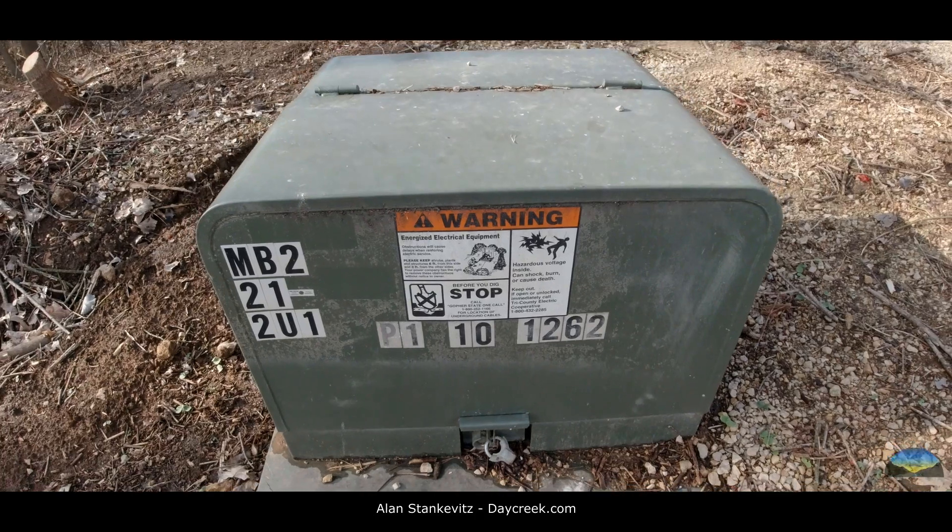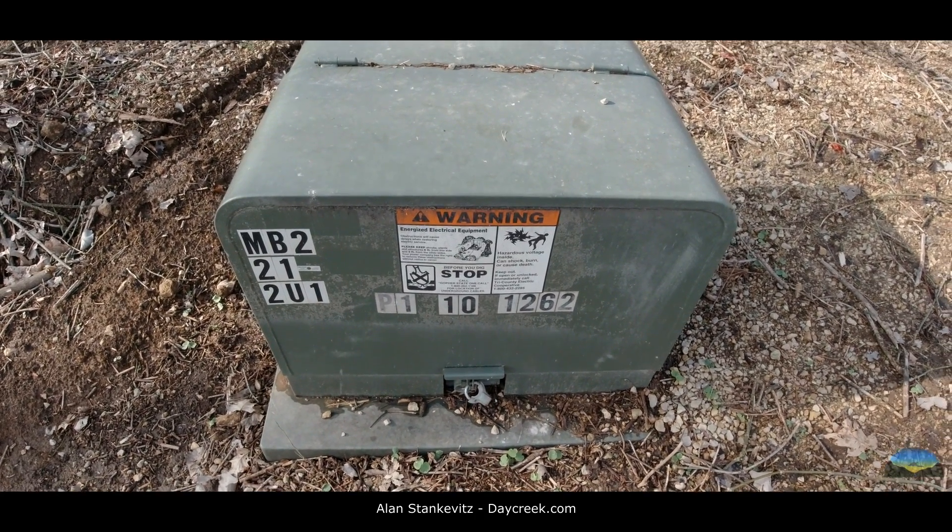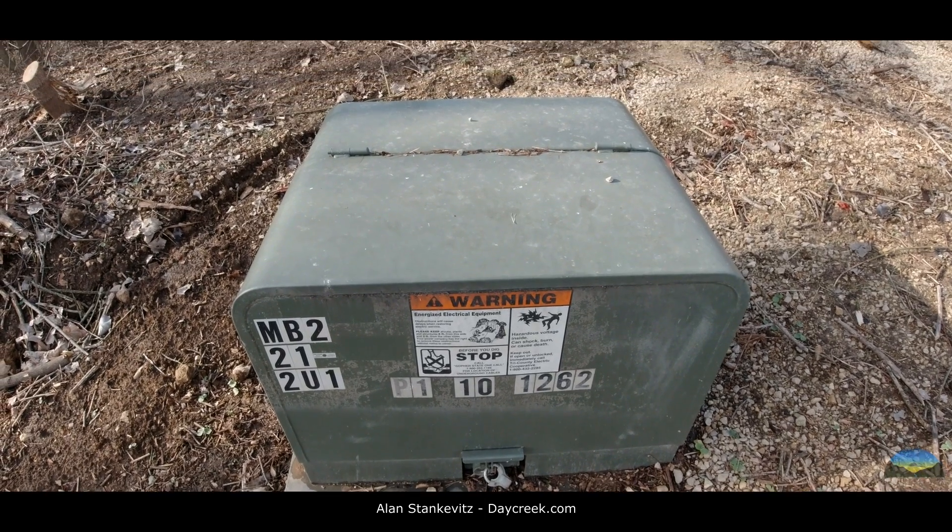If you live in a rural area such as Joe and I, we have our own transformer. It's a small transformer, however, and it's only capable of 10 kVA or 10 kilowatts. What that means from a solar producer standpoint is that if I want to sell my surplus power back out onto the grid, I cannot go over 10 kilowatts. Since we already have a 5-kilowatt inverter, I can only add another 5-kilowatt inverter to give me a total of 10.